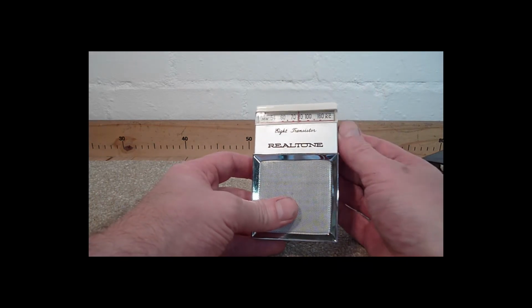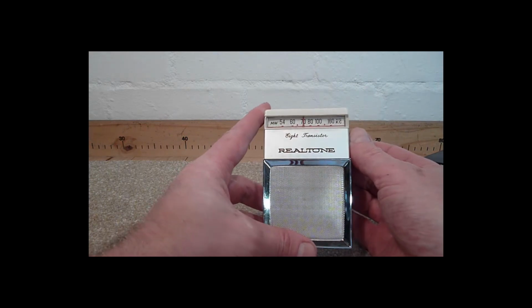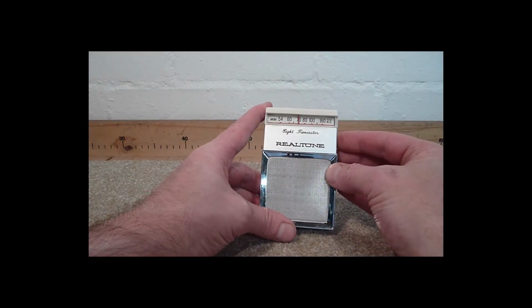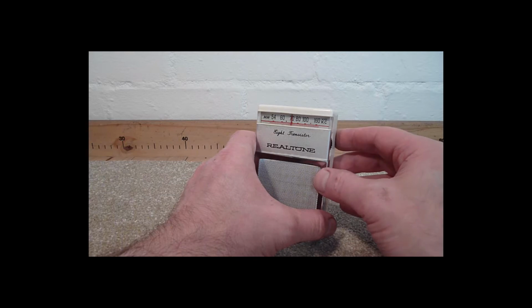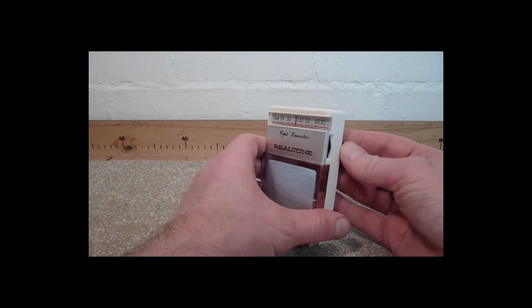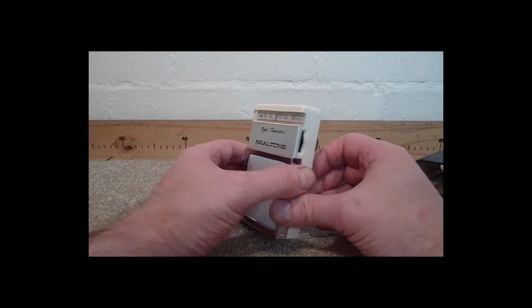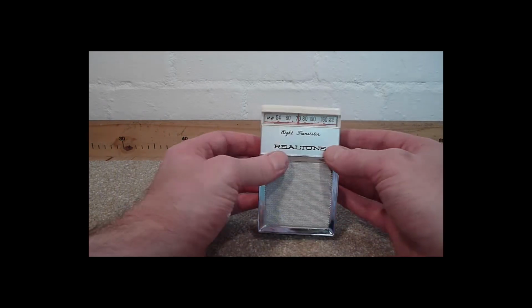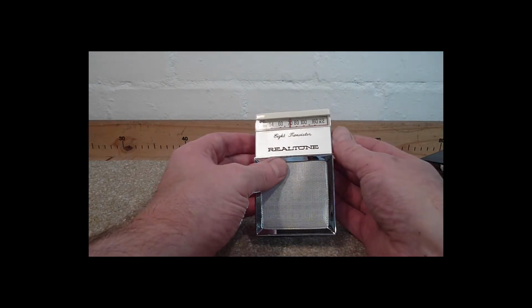There we go. See if we can get a station. I say I haven't touched these at all. They're very directional, as you can probably tell. I've also got a lot of electrical noise generating in this garage at this moment, which is where I'm making this video from. The simple reason is they just use small power supplies that tend to radiate noise on that medium wave frequency. But let's see what we can do. Ooh.